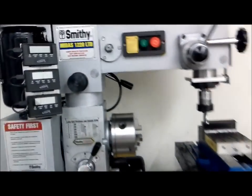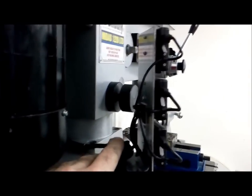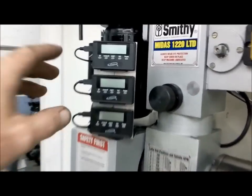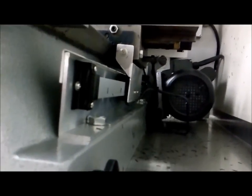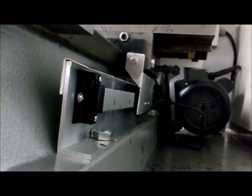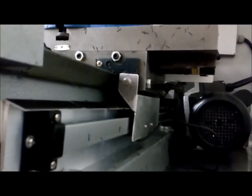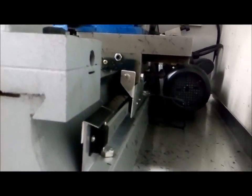I was just going to show the install real quick. I made this little L bracket as a thumb bolt so I could take it off if I need to swing the head out, and mounted all three axes — Z, Y, and X. I'll show you the longitudinal travel. I basically made an L bracket and mounted it down to the two bolts that hold the machine down, and made a little cover to keep debris off the rail. I fabricated that piece out of aluminum and mounted it to existing holes on the machine so I didn't have to drill any holes.